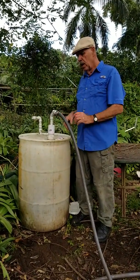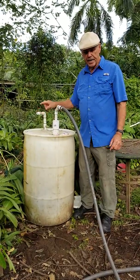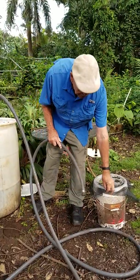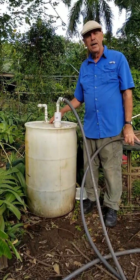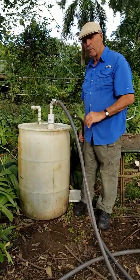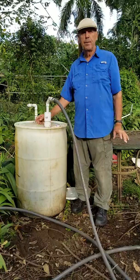When they're done and a client comes, I take the garden hose off and switch the air compressor over to this side, then put the end of the hose into the client's container — whatever they have, or a five-gallon bucket like this. The trick is to put a piece of window screen over it so flies don't get in. Once it's fully fermented, it's not nearly the fly attractor it was before. There's a faint aroma — more of a perfumey fish smell — much better than a raw odor. When I put compressed air in here, it pushes down on the liquid and pumps it up — a displacement pump with no moving parts.